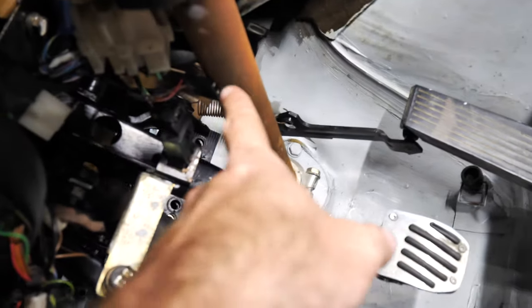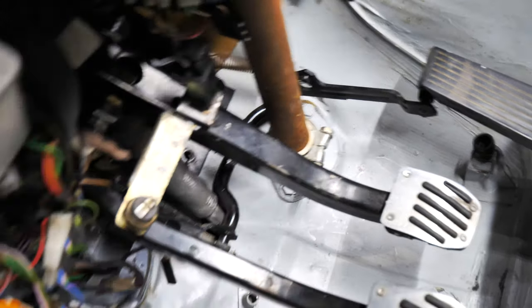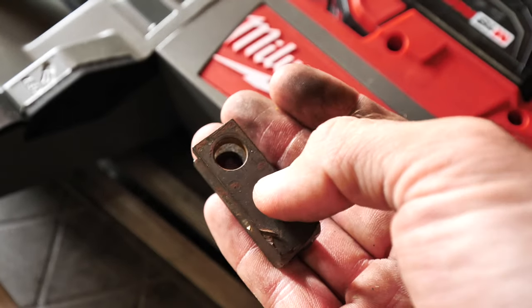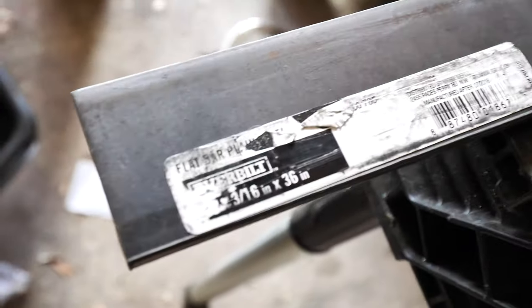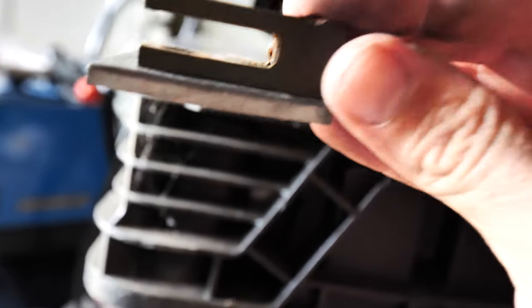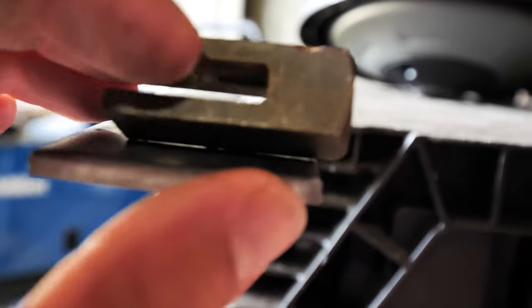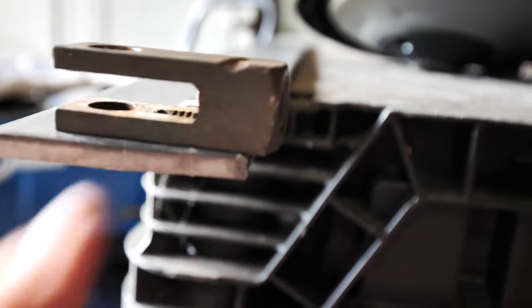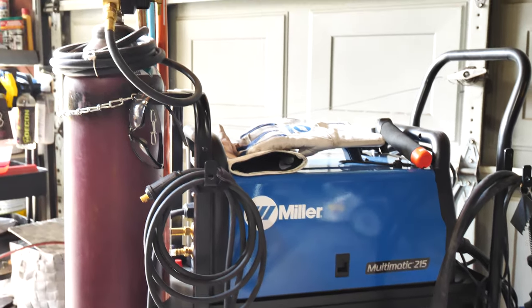I drilled a hole at the top of the booster piece so the nut will slide through. Now this should slide on without issue and I should be able to get a nut on there as well. Now we're on to clevis modification time. What I need to do is make basically an extra little leg here and drill a hole through it. I'm going to need a welder and something to cut some steel. I went ahead and picked up some 3/16th inch plate - that is the same size material. I'm going to be welding on basically a third leg with a spacer piece of steel in between, and I'm going to use my Multimatic 215.